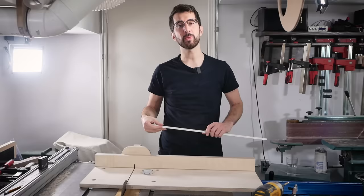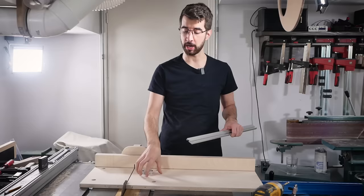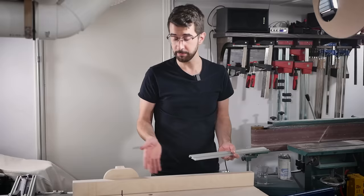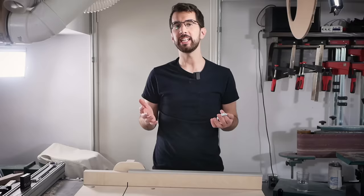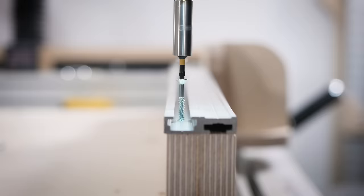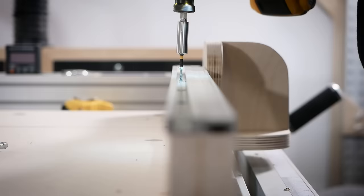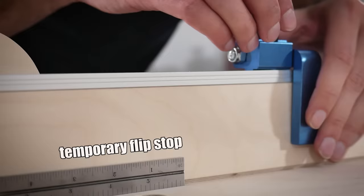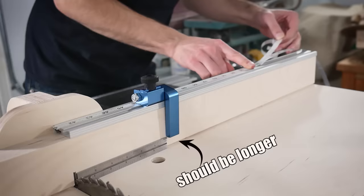I'm also partial to having an adhesive measuring tape on the track so I can quickly cut a board to an exact size without fussing with an actual tape measure. Some people don't find it accurate enough, but it's totally fine if you plan your cuts accordingly. I chose a T-track with a built-in spot for adhesive measuring tape — it was near the same price as a regular T-track so it just made sense. I got this T-track from Lee Valley along with one of their flip stops. For the adhesive measuring tape, make sure you get one that reads from right to left. Installing the T-track is as simple as lining the right edge with the blade kerf and countersinking some number six screws in the slot. You can then use your flip stop and a steel rule to measure a known distance from the kerf and apply the adhesive measuring tape.